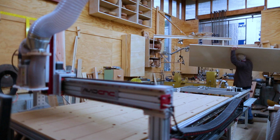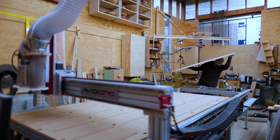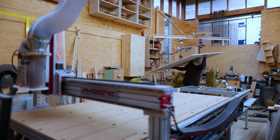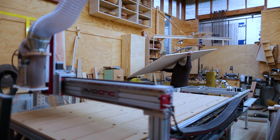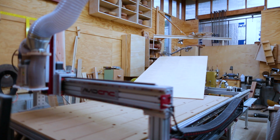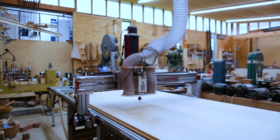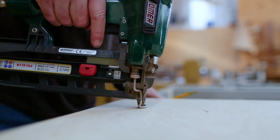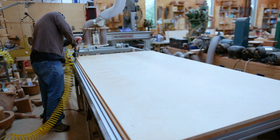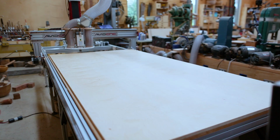In making the boxes, I started by laying 4x8 sheets of plywood onto the CNC machine, and I could cut the grooves for the drawers to slide in and the dado at the top and bottom of the box pieces. What I ended up doing was only cutting those things on the CNC machine on the full sheet of plywood, then cutting the parts for the boxes out of those sheets on the table saw.